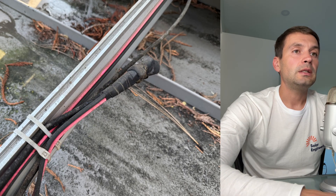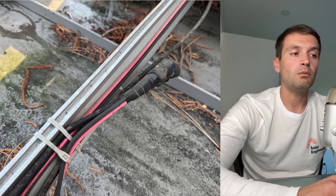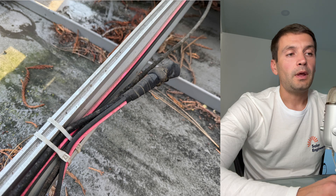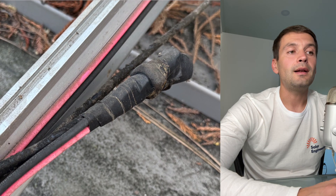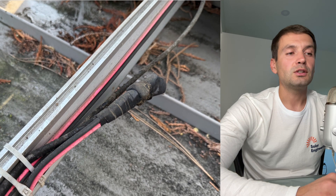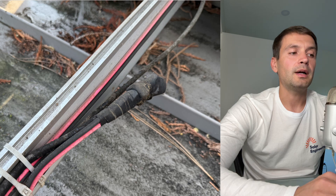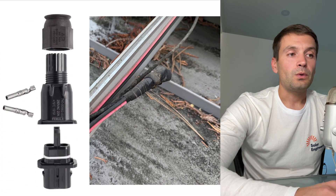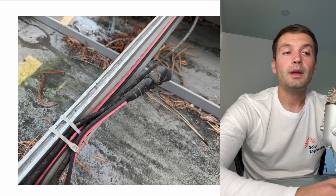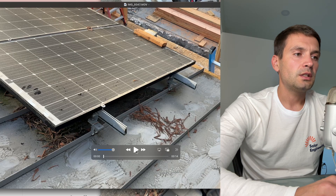In this picture we can see the trunk cable — and because it's microinverters, we have AC current in those trunk cables. It was connected to a junction box using PV wires, and those connections were made with just electrical tape. I didn't touch this connection, but of course it's not the appropriate way to connect a trunk cable to a junction box. We need to use Enphase cable and Enphase connectors. This is a safety hazard — over time, water getting into this connection can start leaking AC current onto the rails and onto the roof. Hopefully the circuit breaker will trip.